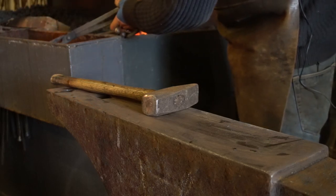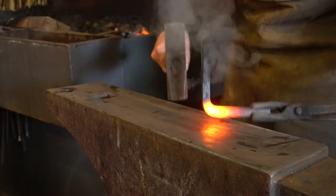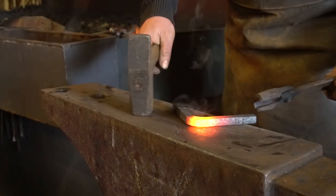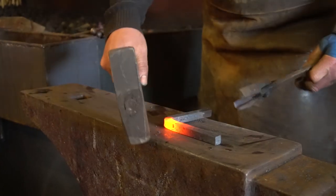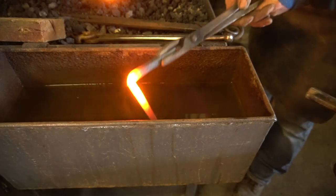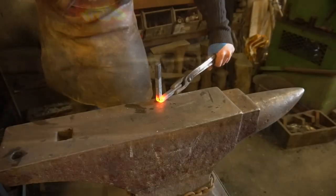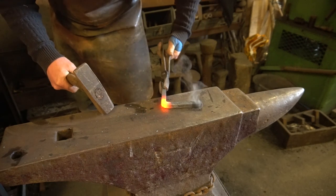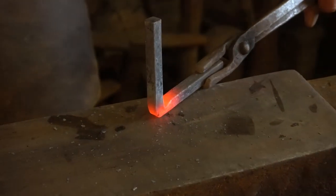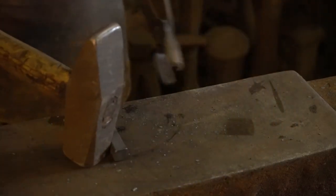Out of the fire, cool down the piece — we don't want to bend. Leaving about half an inch above the corner, I can come in at 90 degrees. Initially I don't want to go too far, otherwise I'll knock my center punch out of the corner. So I've done that side. Quick heat on the other side, quick quench — got to be quick. Repeating the same action, center punch on this side this time. I'm also pulling my hammer blow over to the edge, because I don't want to over-bend this corner.